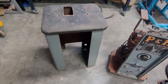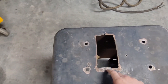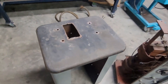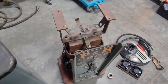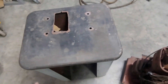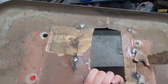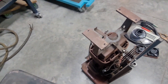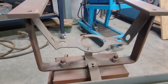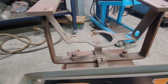First thing I did when I bought this was pull the case just to inspect everything. You can see that somebody had cut a hole in this lid. One of the few discussions I found about this online, somebody mentioned that these didn't have great cooling, so I'm not sure if this originally had a fan — maybe it was mounted down here. But this hole was probably cut for cooling. Unfortunately, right where they cut is where the wiring came out. But anyway, they did put a fan in here — this little bracket was added. It was actually a little GE cast iron condenser fan, I think straight out of a refrigerator, and it was 110 volt.